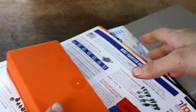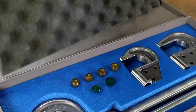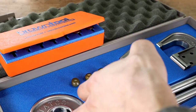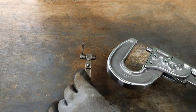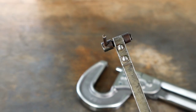When this saw was forged, the second arm was inserted into the end clip and then it was attached to the frame. Two rivets hold it into place, so if you want to remove the arm, just take out these rivets. This is relatively easy to do — just use a grinder, file, or a chisel from a punch set to remove the head and then use a punch to push out the pin. Here at One Nation Restorations, we try to preserve as much of the original piece as we can, including the 100-year-old rivets. If that doesn't matter to you, I recommend using an American-made hand rivet squeezer and dimple like you see here.